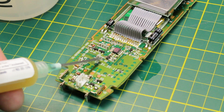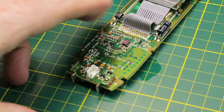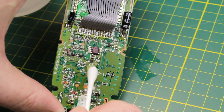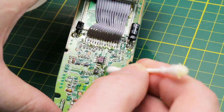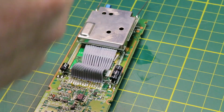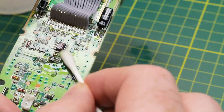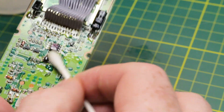You can use this on corroded terminals or if you have to remove some flux. In the event that you're working with flux on components, after you're done your soldering, you want to clean it off. And if you don't have an ultrasonic cleaner or something of that form, a good old q-tip and some alcohol works wonders. In this case we've got quite a bit on there, but no problem — it'll dissolve it really nicely and you can just clean up your board.